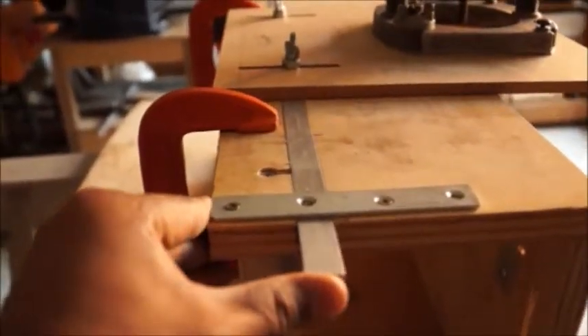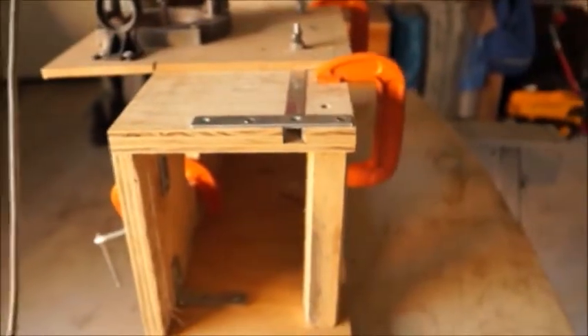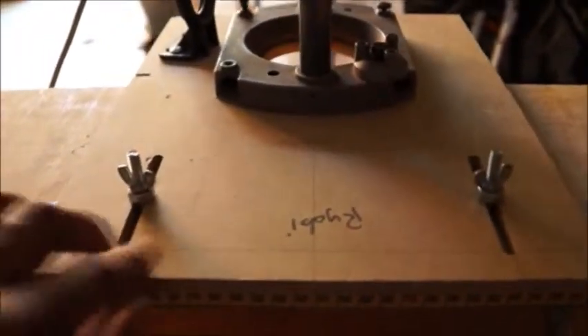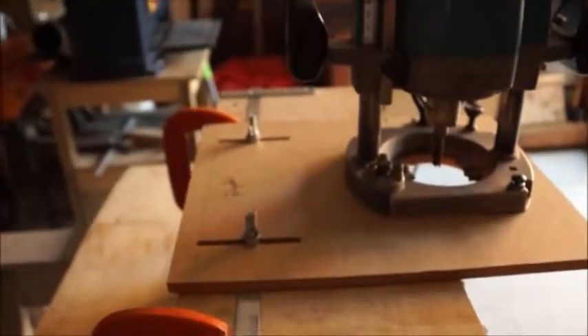This part of the construction is very simple. All it is is a steel rod, and you can see the groove that I've cut into the plywood. Into that groove I've simply put in a piece of metal — in fact it's a hollow piece. Onto that I have screwed two wing nuts which allow us to have this router base plate mounted onto this metal rail, and that's what allows us to move the router back and forward.